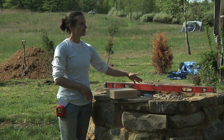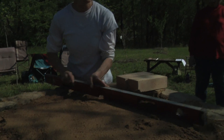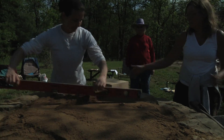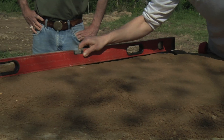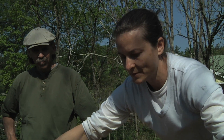We need to lay them flush to each other so that our floor feels completely smooth, and the easiest way to do that is in a sand bed. We just want to make sure the stones aren't going to catch and that the stones are what holds up our bricks. If you don't have a level, you can just use a very straight board.